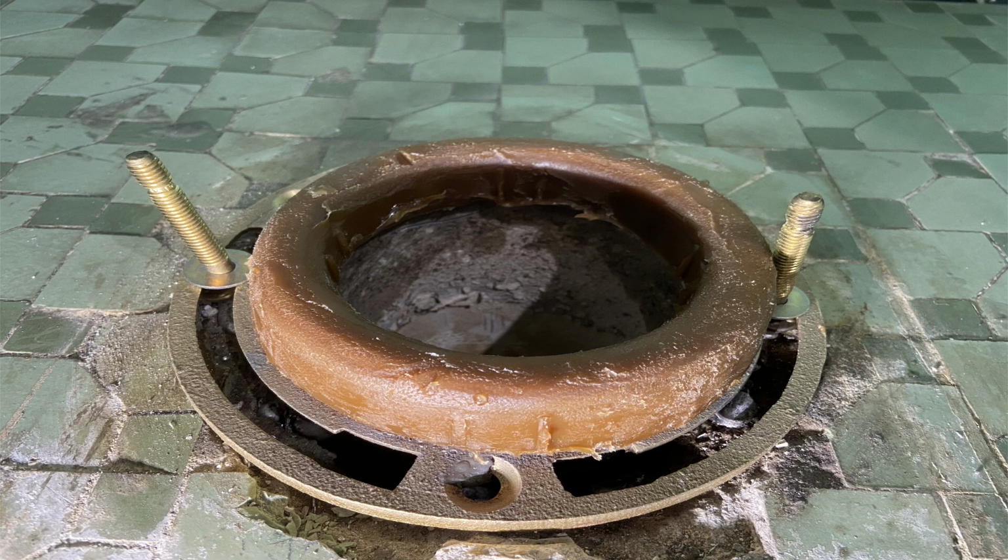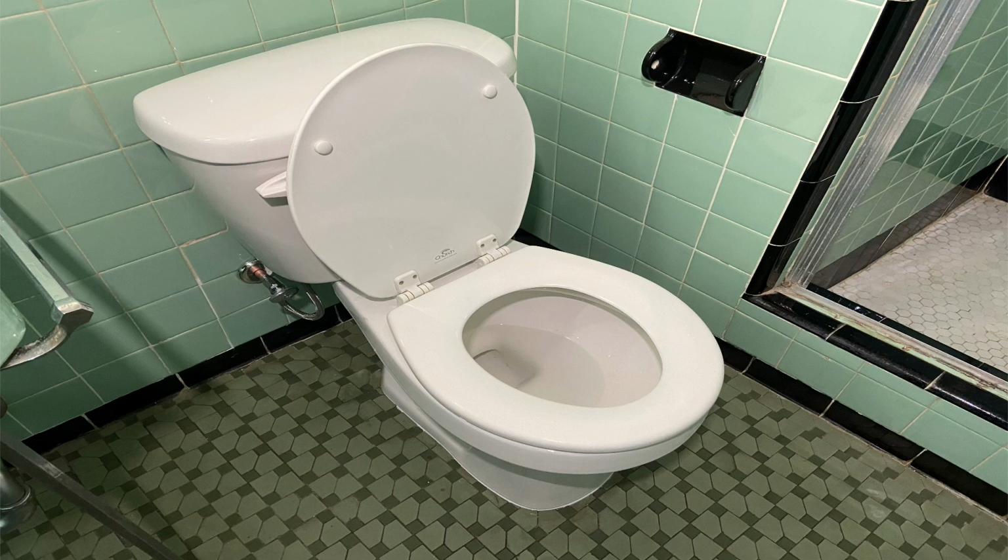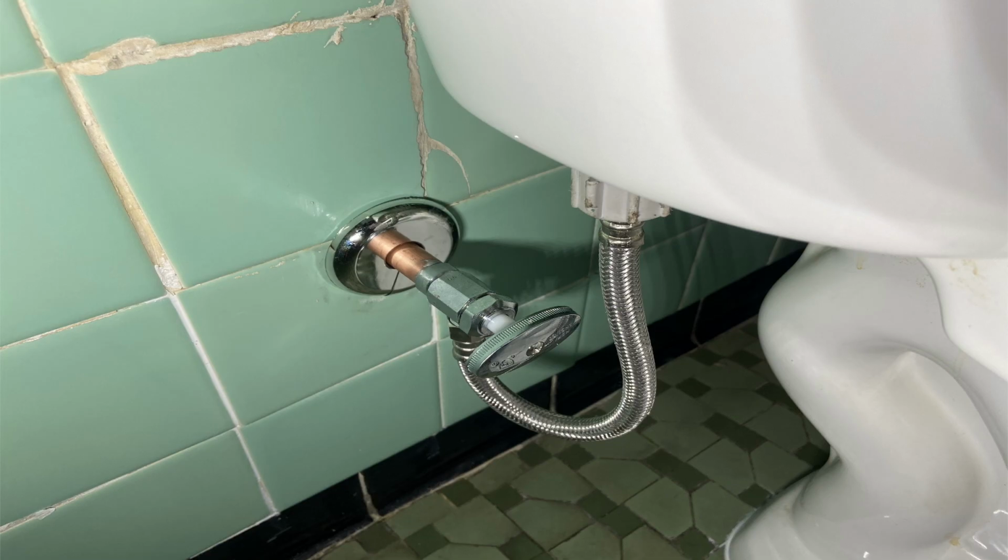And then I follow that up with a water-based silicone caulk. And this is the finished job. She was happy. Everything worked out well. And while I was at it, she did not have a shutoff valve underneath this toilet tank. I had to shut the main off. So while I was at it, I actually changed the nipple coming out of the wall. I put a new shutoff valve, a new toilet supply, and that's the job, guys. Relatively easy, relatively simple, if you know what you're doing.